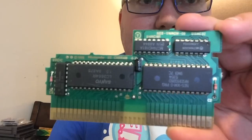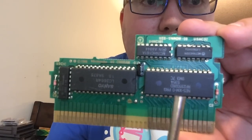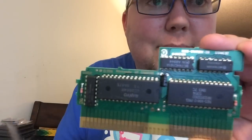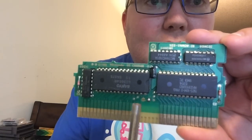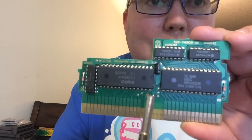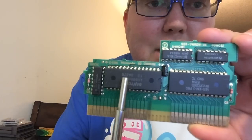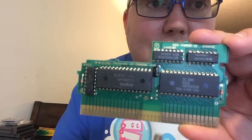Now the UNROM is a little different from other boards because there's one extra step in making UNROM repros that you don't have to do on any of the other Nintendo repros, but there's one that you have to do on some UNROM boards, and I'll tell you why coming up. There are two different board types. You have this one, which is a UNROM - says so up there - and this game only requires one chip, only one EEPROM, so that's going to make it really easy for us. Like NROM and CNROM games, it does have mirroring, whether horizontal or vertical, so you've got to watch out for that. This chip stays in place - just the one chip right there for UNROM.